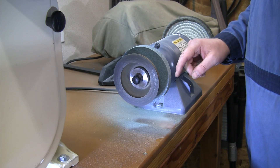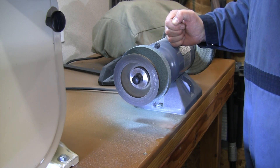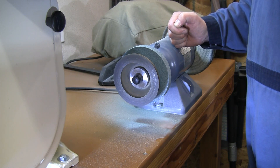Once I've hit it with the diamond dresser it's nice and flat. You can see it just takes a couple of rubs across there with the star dresser to open that up a little bit, and that's it. This wheel is now ready for sharpening brazed carbide tool bits. If you want to see more about that, look up in the top right corner of this video and you'll see a link out to the video on sharpening brazed carbide.